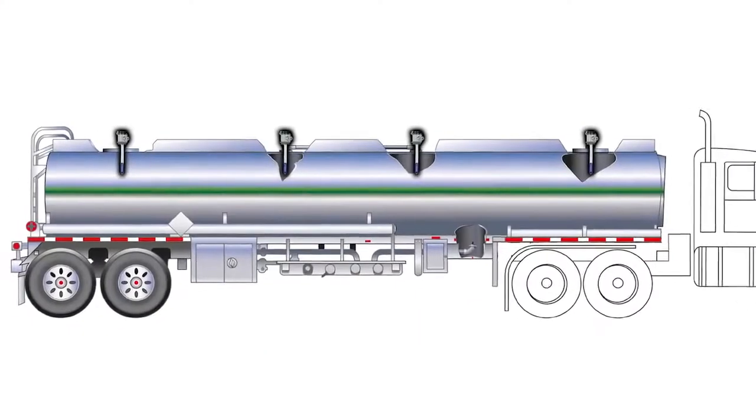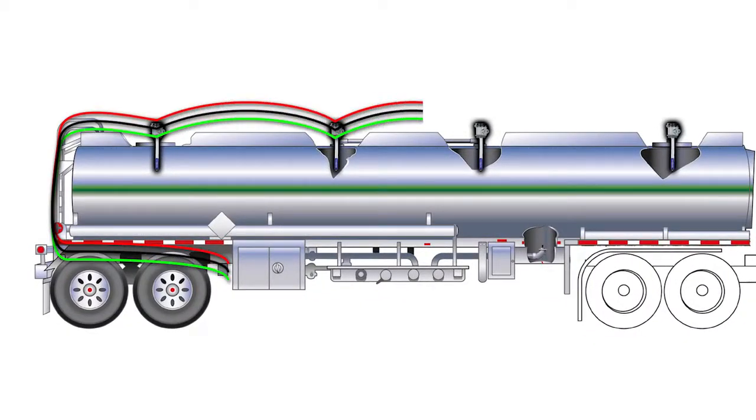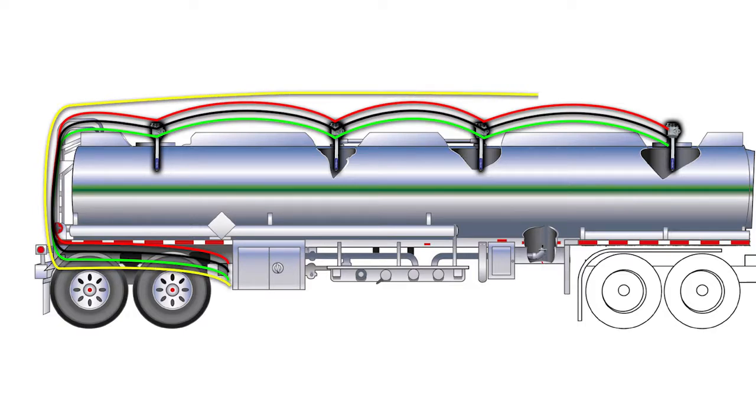The way that a 5-wire system is wired is: the red, black, and green wires are all wired in parallel. When the yellow wire reaches the number one probe housing, it is connected with the yellow wire of number one sensor. The orange wire coming out of number one sensor then hooks to the yellow wire of number two sensor. The orange of number two goes to the yellow of number three, and this continues until you hit the last compartment of the unit. The last sensor in the trailer or tank returns back down to the socket.